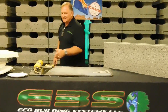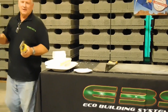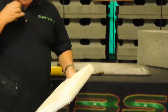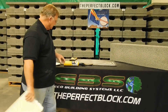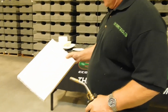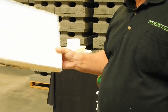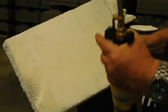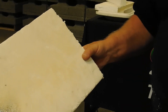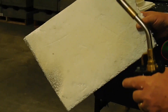The nice thing about this is that when you burn EPS, EPS flames in seconds. I'm going to do a quick demonstration, only for a few seconds. Don't do this at home, don't breathe it at home — we've got a fan behind us. I'm going to show you what happens when you take virgin expanded polystyrene and apply a gas torch to it. In this case this is map gas, burns at around 3,700 degrees Fahrenheit in air.